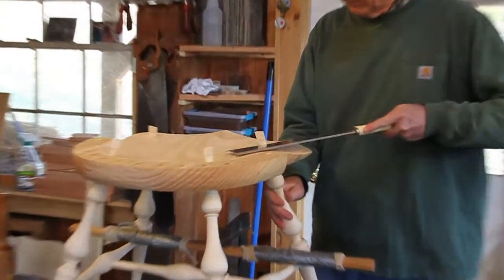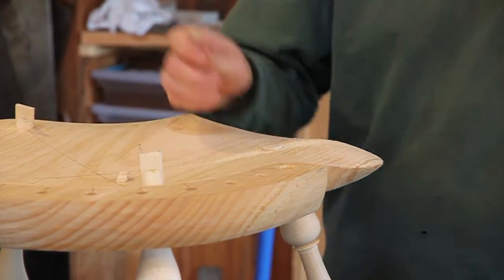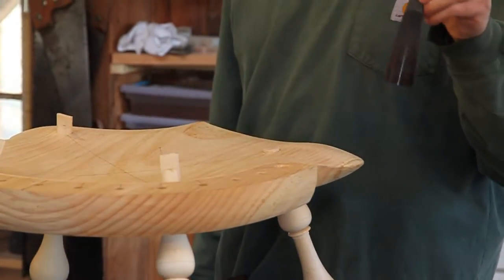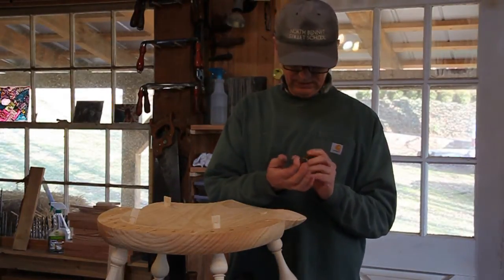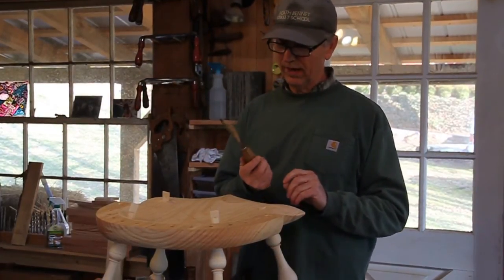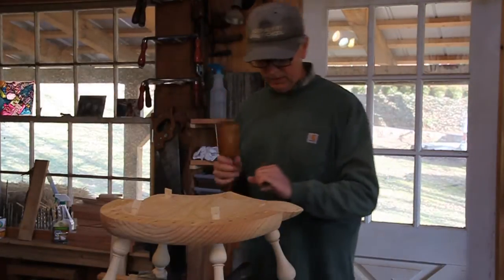So I saw it a little bit proud. Then I take one of these gouges right here — it's got a number three sweep on it, and the width is 35mm. I think the brand is Pfeil. I don't know — anybody know how to pronounce that? And then I just use this mallet and go to work on it.